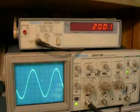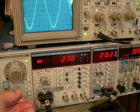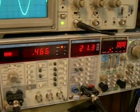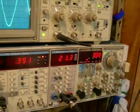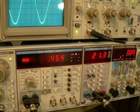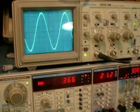Waving our voltage. A nice steady 0.4% at 21.3. Nice power — 21.3 squared divided by 8 is 56.7 watts at 0.4% distortion. Not bad.